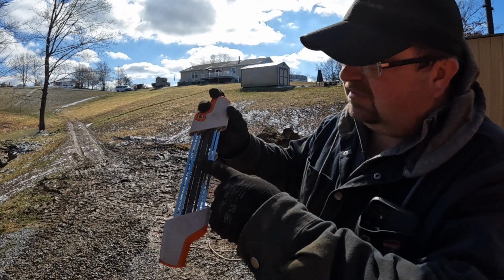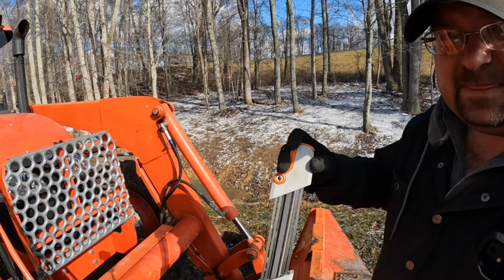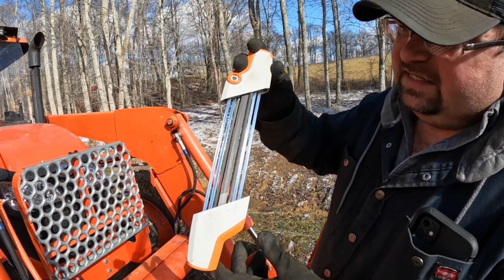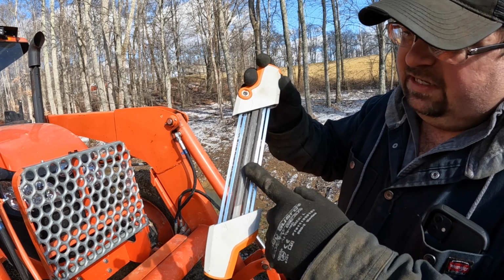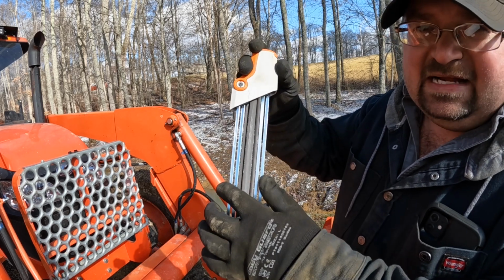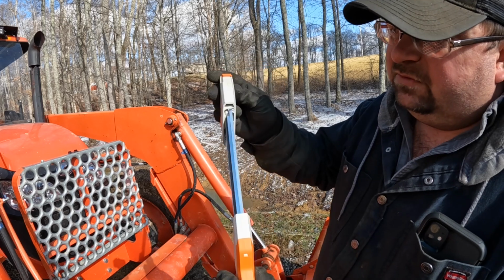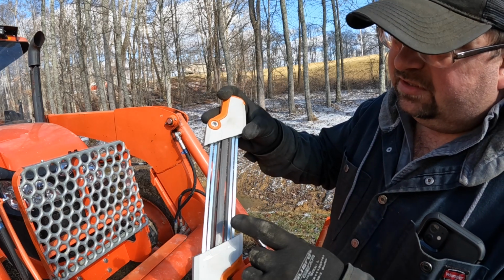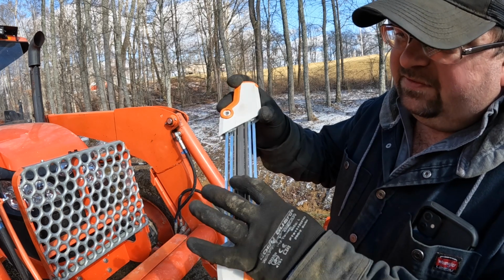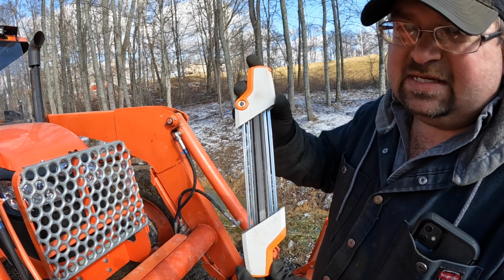The sun's probably shining on you all. Let's see if we can move around here. But they've got a flat file here, a round file here, and then these guides that control your depth. One side is for one side of the chain, the other side is for the other side because of the way the files are positioned and the angle of this. But anyways, this file files the drags on your chain while that file's filing your tooth at the same time,